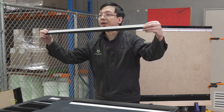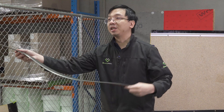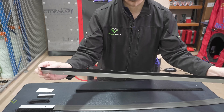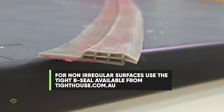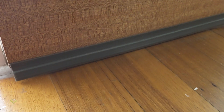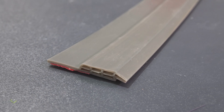So what options do we have? Typically we will have this kind of rubber flap seal to allow for wheelchair access. One of our own products is the B-seal series — compared to other alternatives, our advantage is we have multi-layers of flaps. When the door moves, even if one layer stretches to one side, the second layer remains in shape to hold the seal. It's very similar to the multi-blade concept in shaver advertisements.